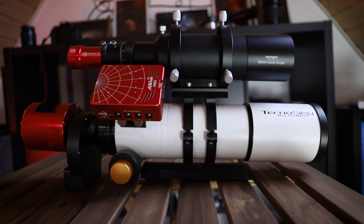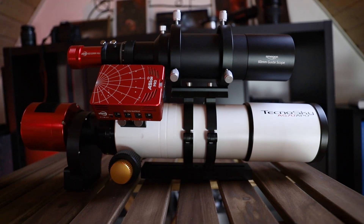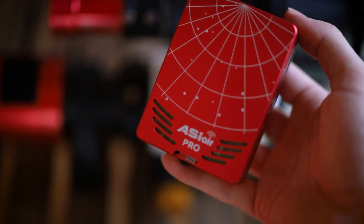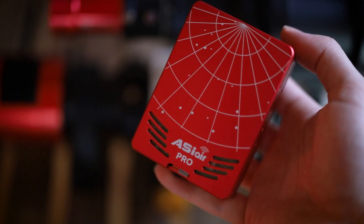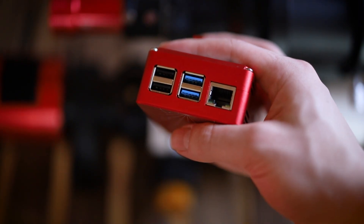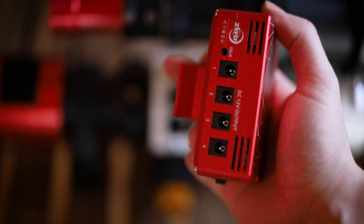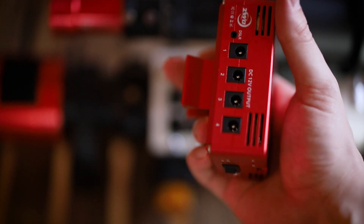That's a pretty long name for such a small camera, but it is a mono guide camera. In the back, my good old ASI 294, the ZWO color camera, and the last new gadget — the filter wheel. This is the ZWO Mini filter wheel and it houses up to five filters, 1.25 inches. The ASI Air Pro is a small Raspberry Pi computer and it's designed to suit all of your astrophotography needs. It has four USB ports and one serial cable for the mount, and four different power outlets on the side and a DSLR input.